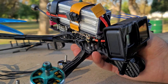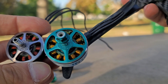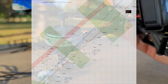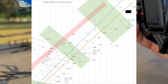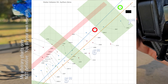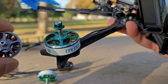Back to the motor — this motor is different. It is made by Brother Hobby because they are very similar designs, but they're not the same. The winding has an upgrade on the enamel — higher temperature windings — and it has a 13mm bearing instead of a 12mm bearing, along with a couple other changes. The size of this motor was determined by looking at my charts and testing so many motors. I find recently that 2806 motors are just a little bit small for managing 7-inch props. This motor is about 20 to 21% bigger by volume, and the goal was to fit more power into a low weight. It weighs 5 or 6 grams more than the 2806, so about 55 grams total.